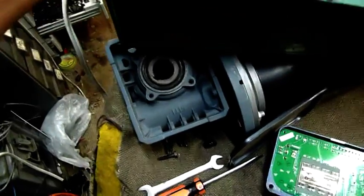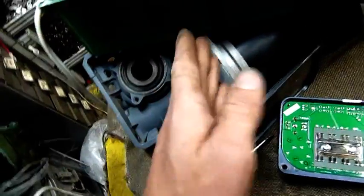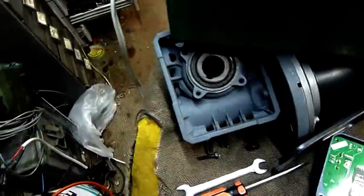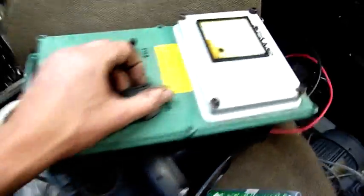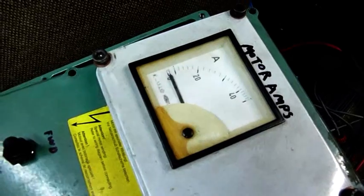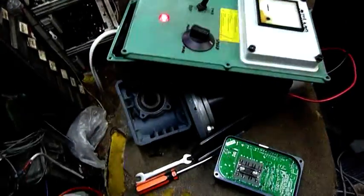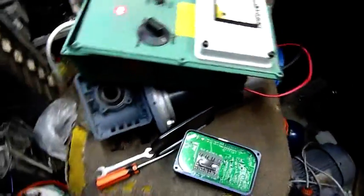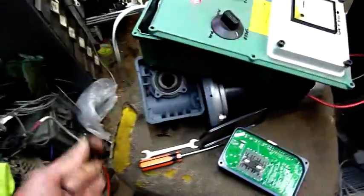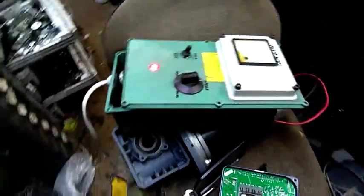That's low speed — it's a bit too slow for direct axle drive on a small vehicle. It'll either have to be a large pulley to a small pulley, a chain drive, or we flange mount it to a steel plate with a pulley coming straight off the motor. The motor does 2,000 RPM and the amp meter works too. Of course with no load it's not going to read very much. The breaker in this is 40 amps, and even though we run a 110 amp controller on the machines at work, it's all fairly overrated for what it is — and with overrating comes reliability.